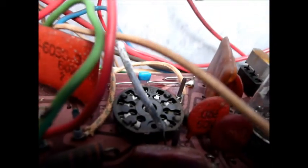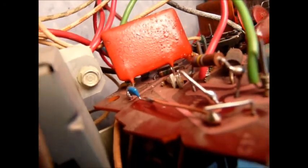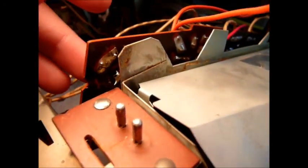I'm working on a few caps on the board and got the one in the back without fanfare. I clipped the old piece out, clipped the studs down, and put the cap across it. It came out fine. I didn't have long enough leads on some of these other caps they sent me, so I tacked long across here. It went fine. Then I noticed the cap standing up here is right at the edge of the board. I went to take it out and put the other one in - now we've got problems. As you can see, the trace is lifted.